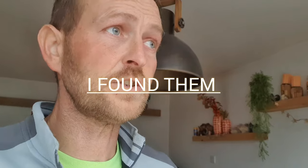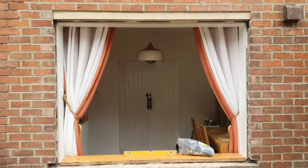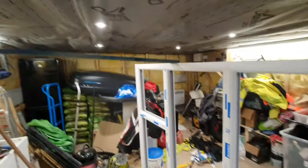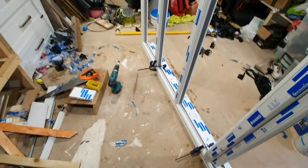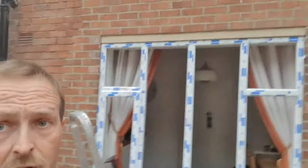It's taken me about an hour and a half. It looks like I'm missing a couple of trickle vents, so I'll have to email the company and get a few more sent out. But other than that it just needs to be sealed. It managed to fit even though the window's out of square. Right, that's the back one out — I've pointed up above it. This one is an absolute dream: the gap is really nice and even on both sides, same at the top. Whoever built the back — the brickies around the back were better than the brickies on the front.